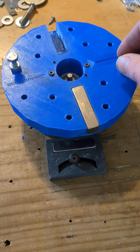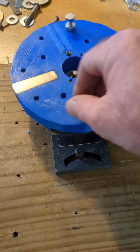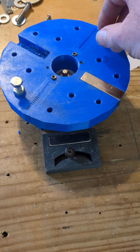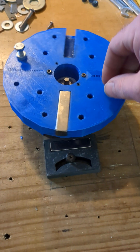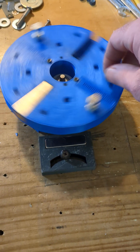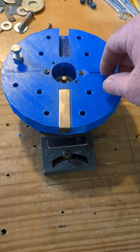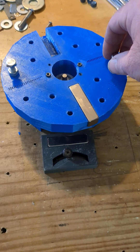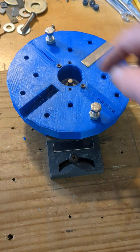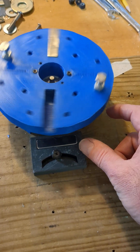That's roughly what it does. Now when this gets aligned with that far pole, this repels it and attracts it at the same time, giving it so much more momentum that it can make it all the way around and then get blocked by the repulsion over here and come around. You get a lot more rotational torque if you go past the entire magnet, because this is repelling it this way while this is attracting it at the same time — that combined force of the magnetic interaction causes it to easily escape the pole.